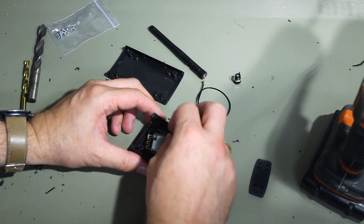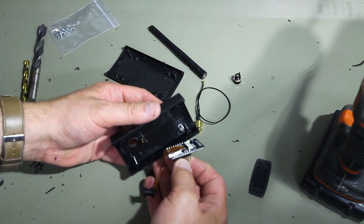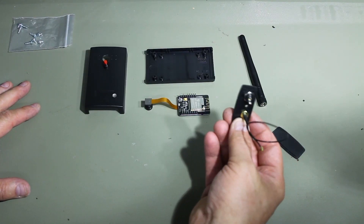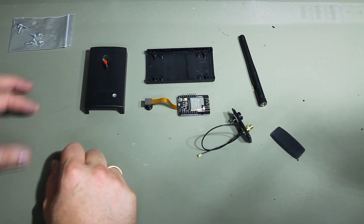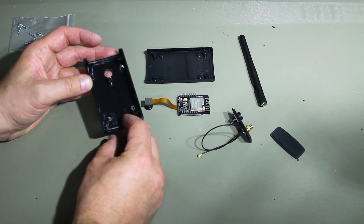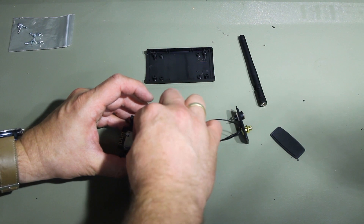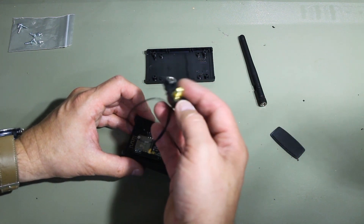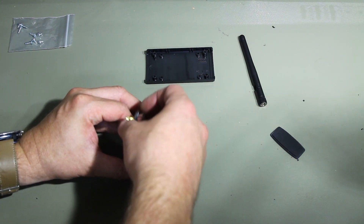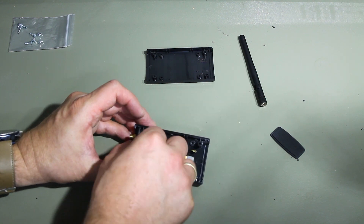I need to shorten the diffuser, but that's exactly what's going on — we have a diffuser that will go on the LED. Now I've put everything in place: the connector for the antenna, the power connector, and the switch. I placed the little diffuser after shortening it in length. Now we place the camera by putting the board upside down and applying some double-sided tape to hold the ESP in place — or you can use some non-conductive putty. That will work.